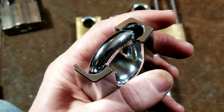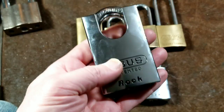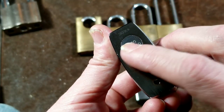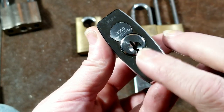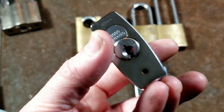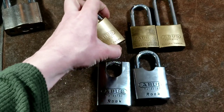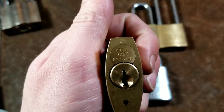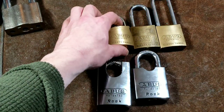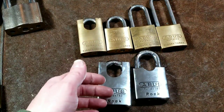For $50 you can get this huge 7/16 closed-shackle hardened steel padlock instead. On the steel versions, they do have anti-drill pins — two in the top part and two in the lower part, although they could probably still use steel key pins for added drill protection. It is a brass core — they just chrome-plate it on the steel locks, and leave it as natural brass on the brass locks. The cores marked C6A have an option to quickly adjust from five to six pins.